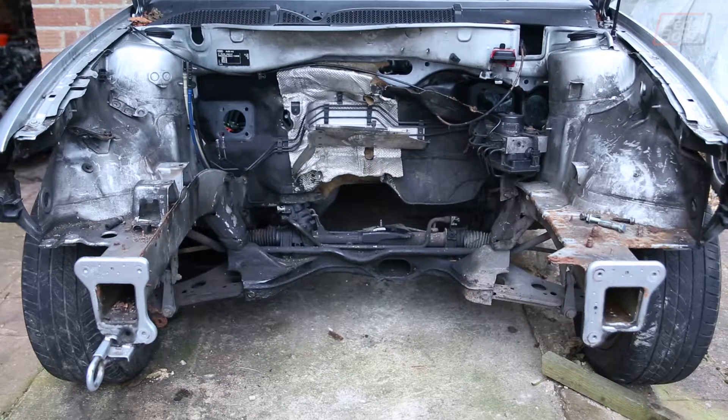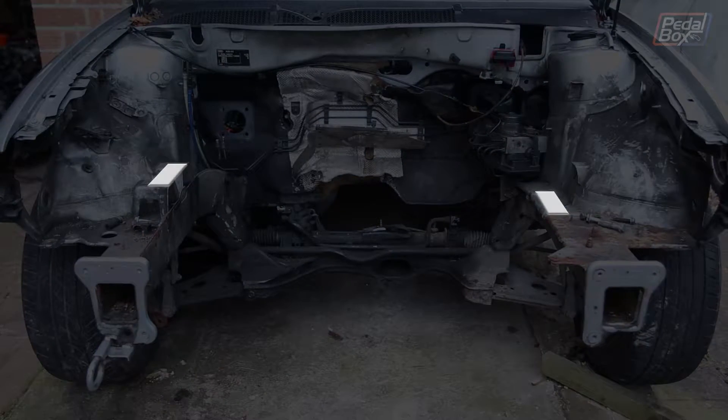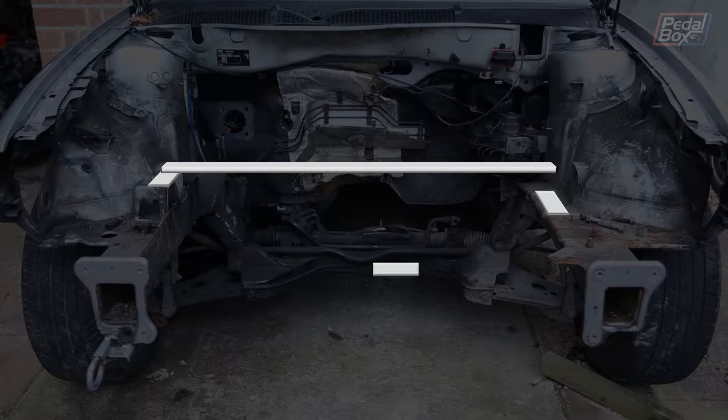The idea for the frame is fairly simple — not much more than a T-piece connecting the top two engine mounts with another T-piece at the bottom connecting the lower engine mount. We'll have a straight piece of metal across the whole top of the engine bay connecting left and right, with a little riser on the passenger side chassis leg because that's a bit lower. Then in the centre of the horizontal piece we'll have a vertical drop down which elbows off longitudinally backwards onto the gearbox mount. So there are four pieces of metal in total — really easy to make.